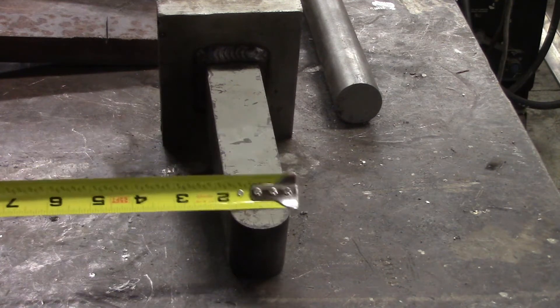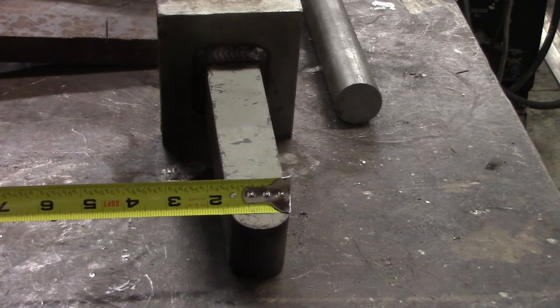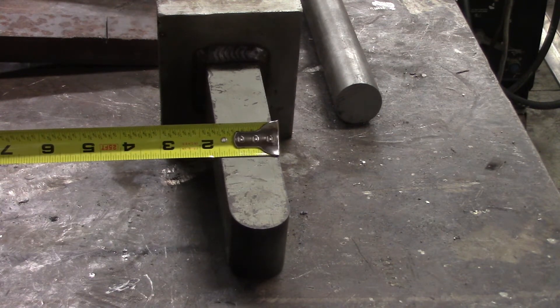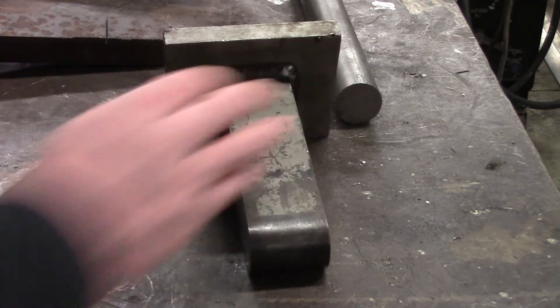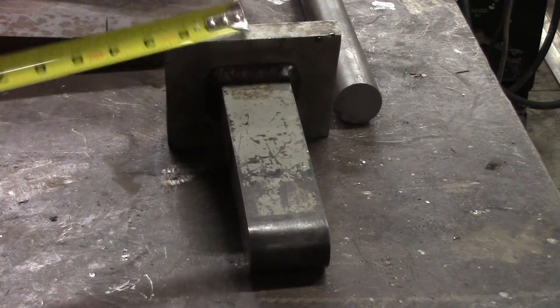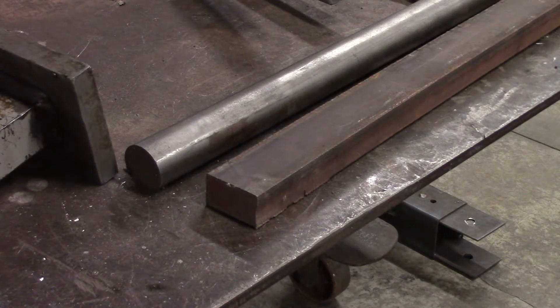This plunger is an inch and a half. We're going to get an inch-and-a-half piece of solid round for the tip, and then get a piece of square stock that is inch-and-a-half by two inch for the rest of the plunger, and cut a half-inch plate out on the plasma. We found a piece of inch-and-a-half solid round, but the bar we have is one inch by two inch — it needs to be inch and a half. So we'll cut that down and add a half-inch plate to make it a full inch-and-a-half thick.